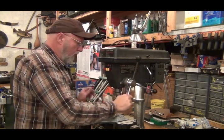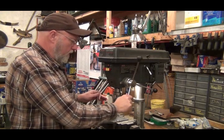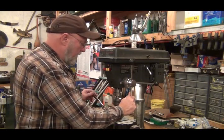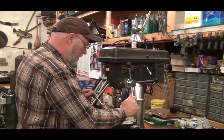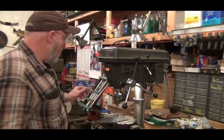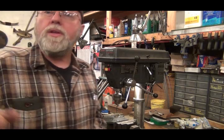As I'm drilling, I'll drill a little ways and then let up, then drill some more. It's kind of like peck drilling the hole — that way I don't get those real long pieces that come out of the hole. They'll be shorter pieces and they don't swing around and get all dangerous on you. Let me move the camera in closer so you can see what I'm doing.